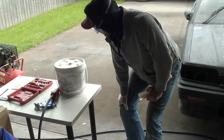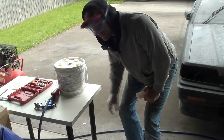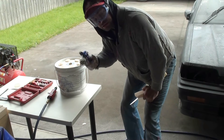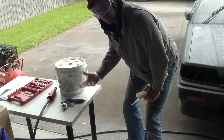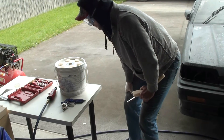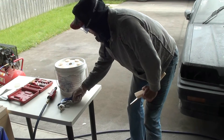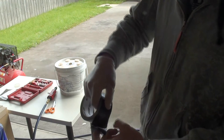Now I'm not sure if these 5 or 6 holes will be enough to provide enough breathing space, given that it does have to go through sponges. But if I need to I'll just drill more holes. Basically I'll fill the spray gun canister with acetone to clean it, put it in here, push it down, and hopefully the acetone will stay in there and the air will escape out through here with the pressure. If any of them pop out I'll just drill more holes — perhaps even on the sides. That should come in very handy for cleaning the spray gun, which is very important. If you don't clean it, the resin will get cured inside and it'll ruin the spray gun. And of course I don't want that acetone stinking up the place, so I'll put a bit of tape over that one remaining hole, which I can take off and put back on when I need to use it.